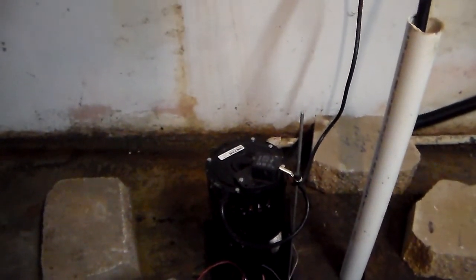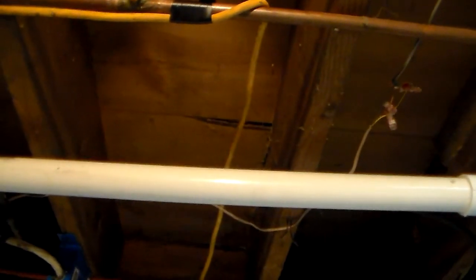What we're doing today is we're going to make a downspout that will fit on this wall and elbow over down into this pit for the washing machine to drain. And then this drain is from our kitchen sink and it goes over into our main drain down over there. We're going to tee into this and run this black pipe out of the sump pump into that — so it'll come up the wall, come over, tee into this from the top side down so it doesn't back-flow. And that's what we're up to.